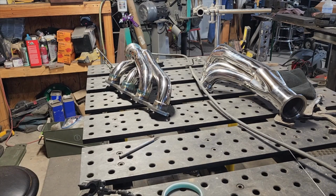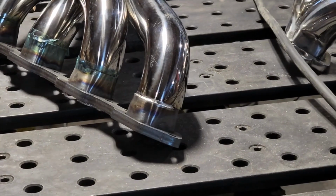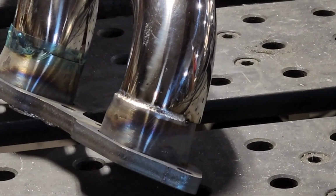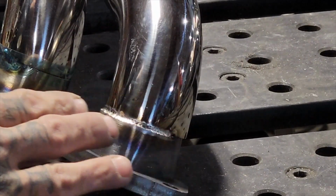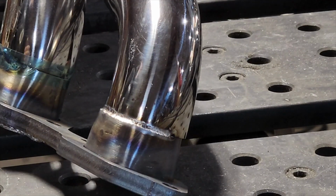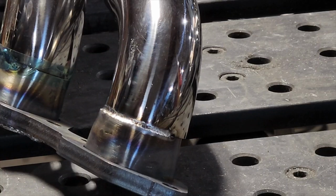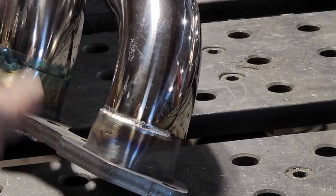And that's turning out nicely. So, you've got good coverage with these cups. There's that nice colorless weld, along with not having too much heat in it, whether that be from putting too much heat in with my pedal or from not heating it enough and going too slow again.